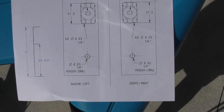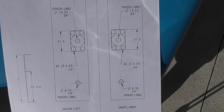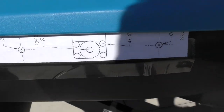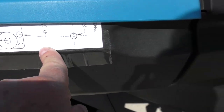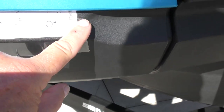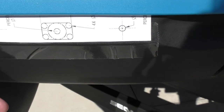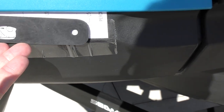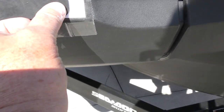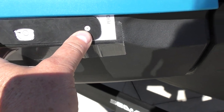The templates will show you the left and right side. Go ahead and cut that out and tape it to the boat where you're going to be installing it. You can double-check your measurements if you need to. I aligned my template where the bottom is along the bottom of this little angle and this edge here, and this goes underneath here. Now I'm going to take the rubber gasket and place it up here just to make sure that everything fits properly — that it doesn't hang down too far and doesn't go up too far.